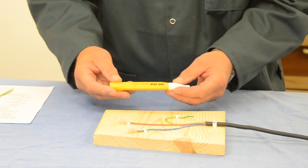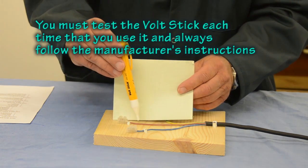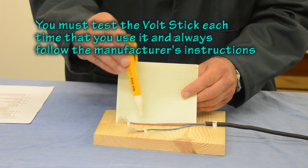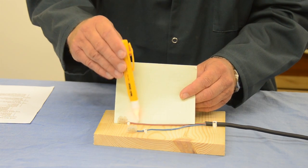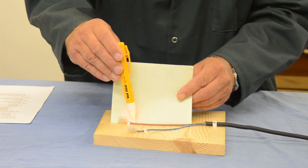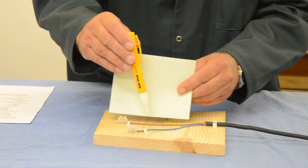That works well, but it doesn't work anywhere where there is insulation. Along comes the fault stick. I'm going to use this piece of paper behind it so you can see the light lighting up. You place the fault stick onto a live wire and it doesn't have to be actually touching a conductor — it's on top of the insulation here and it works. If you do it on a neutral it doesn't work at all, but on live it does. And of course it won't work on earth. If you put it down on the multi-core area it works as well.